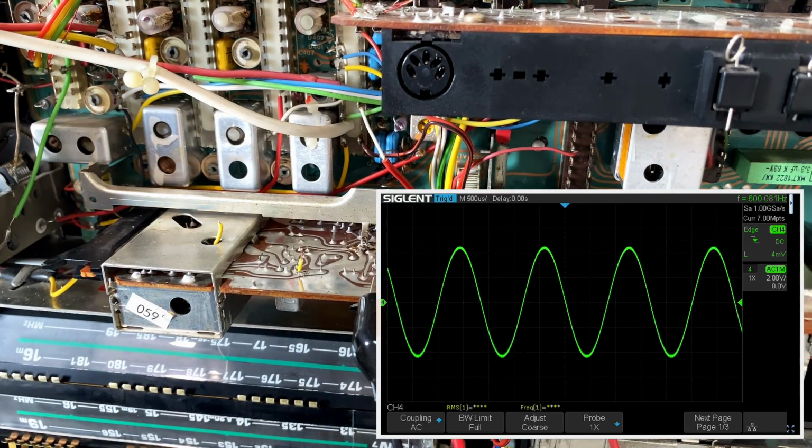And what that tells me is, I don't even know if I want to play with A. That tells me that whatever's being transmitted on the FM band that this thing's picking up, this discriminator is perfectly balanced. And what I'm going to do now is I'm going to leave it like that for now. I'm going to consider it done. I'm going to test it. And if it sounds great, then it is great.